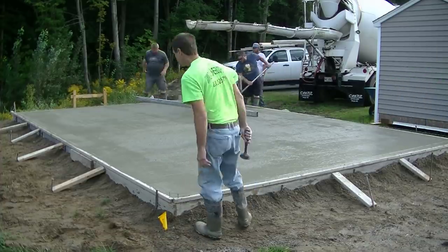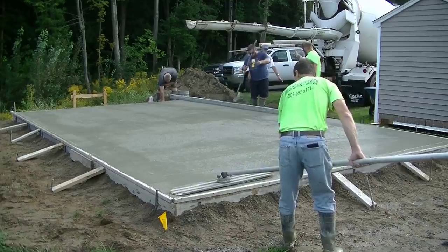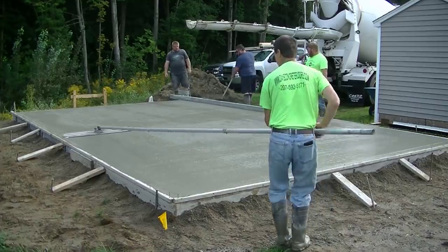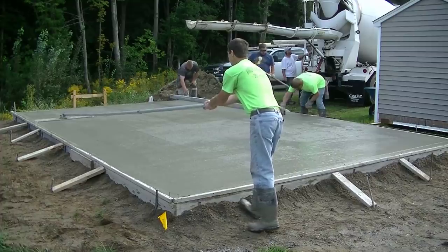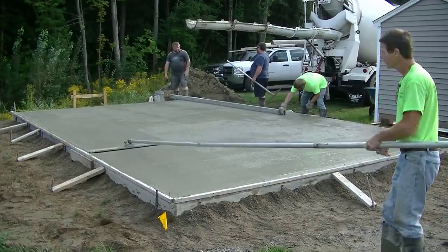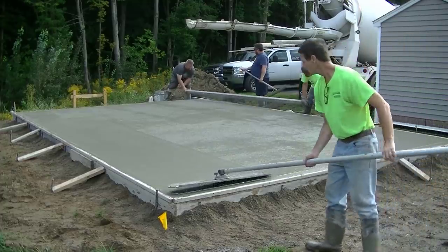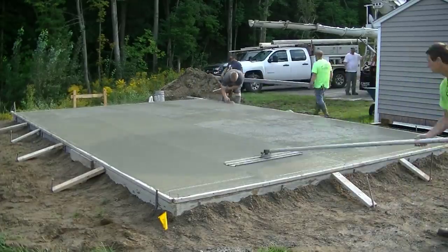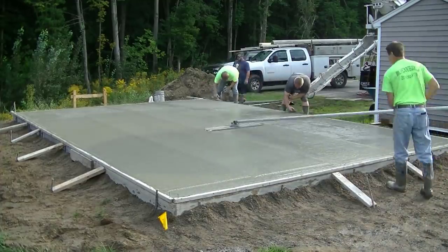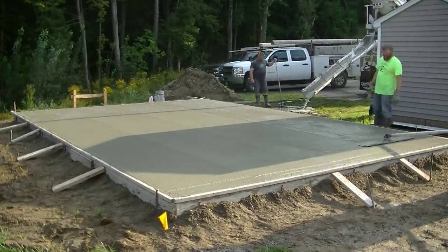You can see we're putting a few kickers in as we're pouring because it's eight inches thick and they didn't leave us a lot of gravel to backfill with, so we're just putting kickers in as needed to keep the forms nice and straight. I'm going around checking our string line making sure everything stays straight. This took about ten and a half yards of concrete — at six inches it was in the seven and a half to eight yard range, so I had to get them for another three yards. We'll put in some anchor bolts, then I'm going to show you how we power trowel and saw cut this.